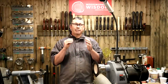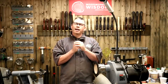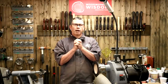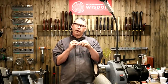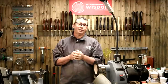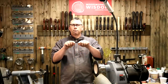It's basically a spindle gouge with a very acute angle, and it gets you into that really fine detail, mainly on spindles, I have to say. Rarely used on bowls. Again, it could maybe be used to pick out a bead if you've got that on the top rim of a bowl, but safer to use on spindle turning. So that would be why. Literally, the name says it all. It's for very fine detail, for cutting down into really fine, precise beads.